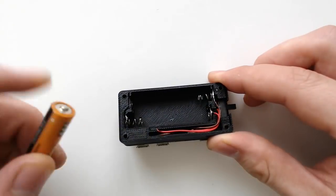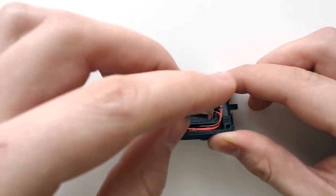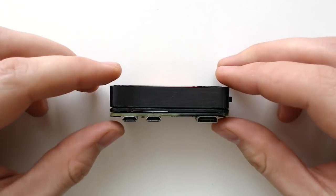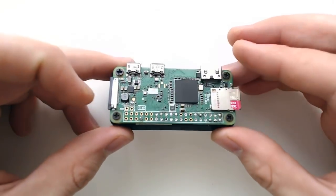It takes two AAA batteries, and depending on the quality of the batteries you get, you can expect 2 to 3 hours runtime. I chose AAA over LiPo batteries, firstly because of the simplicity of the circuit, but also for the cheaper price, the size, and the easy availability of the parts needed.